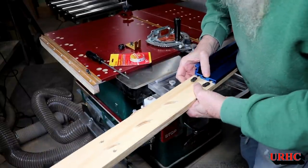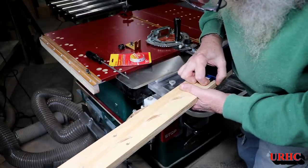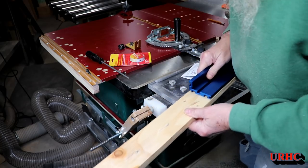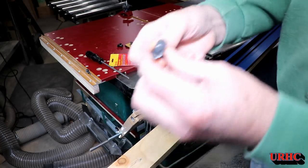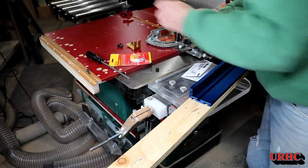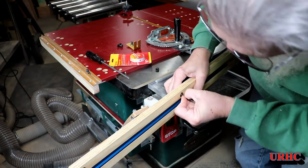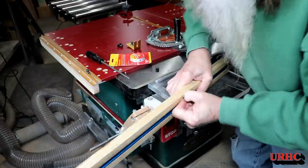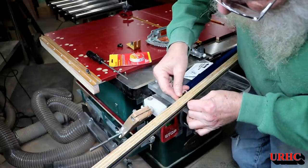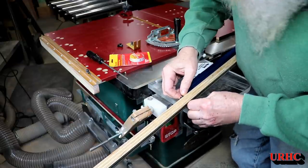As you can see it fits on, and here's that plywood fence board. I'm not going to show you how I made it because it was just a matter of drilling some holes for the T-nuts and using a dado head to cut a slot for a pocket for the T-track. I had a bunch of these little T-nuts left over from my router table build — I bought a bag of 25 of them really cheap. I put a coat of polyurethane on that fence.